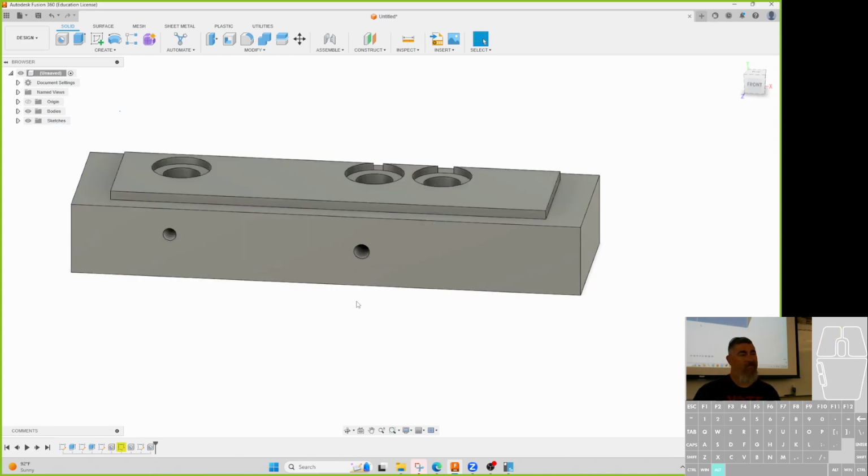So would it be good practice also that if you're making multiple holes, have one to the same hole to the same thing, so you can make a change? Maybe, yeah. That might be a thing that I never even thought about before. If you have a thing that might change between a counterbore or a countersink or a through hole, maybe instead of projecting the top edge, project the bottom edge, because you know that's probably not going to change as much as the top might change. 30 years, light bulb right now, in class. You saw it. Do you see it flash above my head?